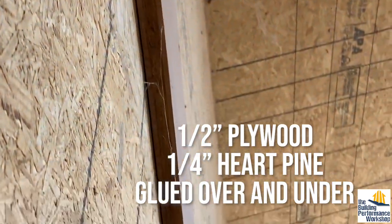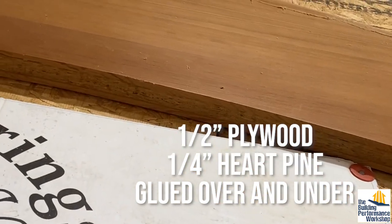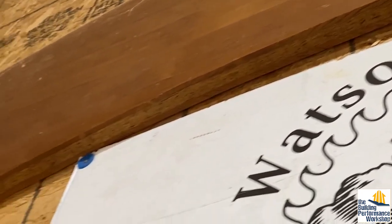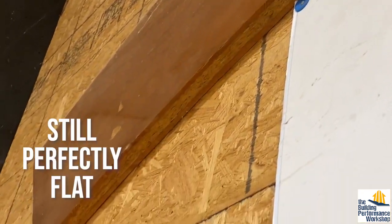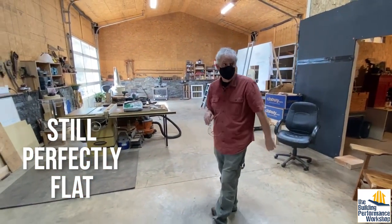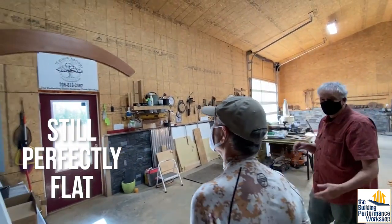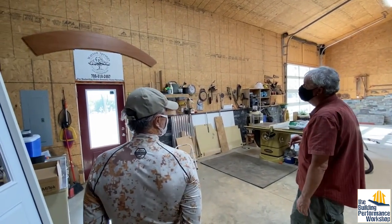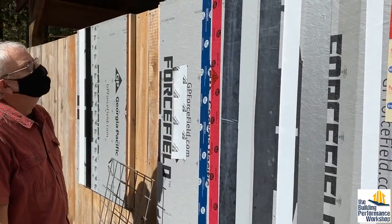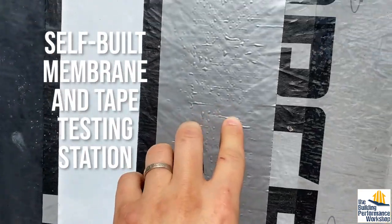It's a piece of plywood — quarter inch of heart pine on the nose with heart pine, and then quarter inch heart pine on top. That thing has been around the barn, just abused, and it's still just as flat as can be. For big stair treads I think that's the only way to do it — we've done countertops that way too, like Amici's downtown Athens where we did all their tabletops. It's really a nice method. This one has been exposed full sun for two years now.